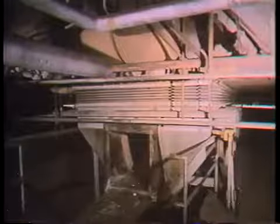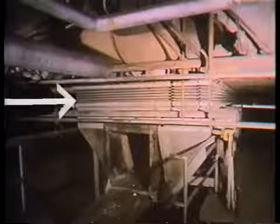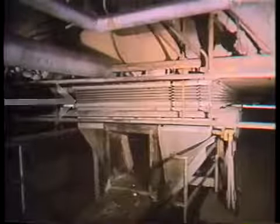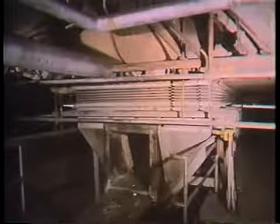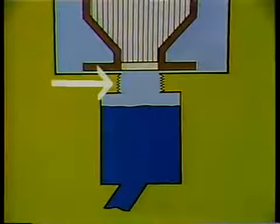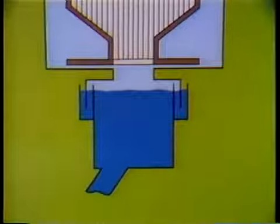The boiler bottom seal is a seal between the boiler and the ash hopper. The boiler bottom seal isolates the furnace from its surroundings. 2 typical seal types are the corrugated seal and the sliding seal. The corrugated seal type allows the boiler wall to expand. The corrugated seal is accordion-like, an accordion made of corrosion-resistant steel. The sliding seal type is an overlapping metal joint which allows the boiler wall to expand. This type of seal uses water to prevent any flow of gas into or out of the boiler.